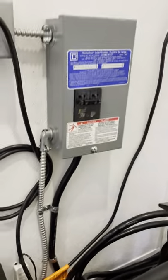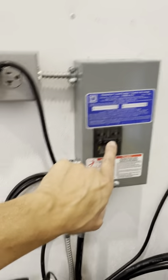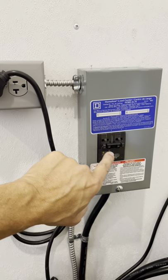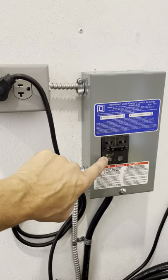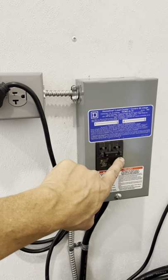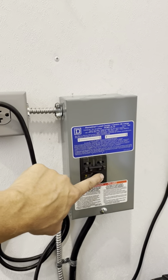For general operation, the electrical box has three breakers. The middle breaker is for the air conditioner and heater. The left breaker is for the outside outlets, and the right breaker is for the inside outlets. All the lighting is 12-volt and runs off this battery.